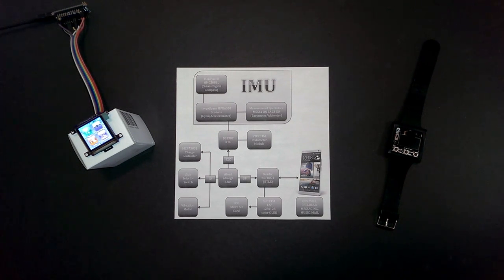At the heart of it all we have the Atmel Atmega32U4 with a Leonardo bootloader. Connected by I2C, we have the DS1307RTC which keeps time and has a calendar on board.